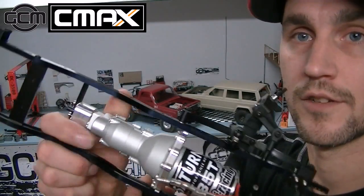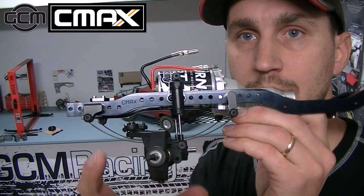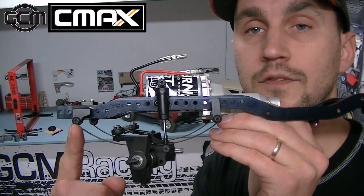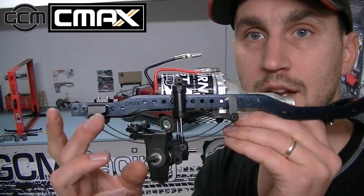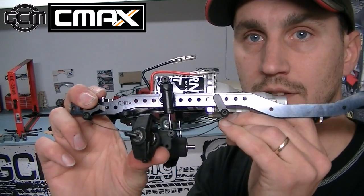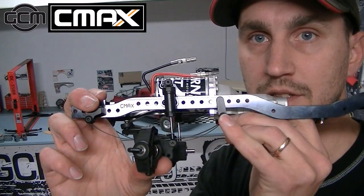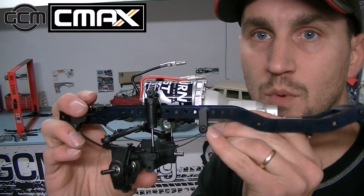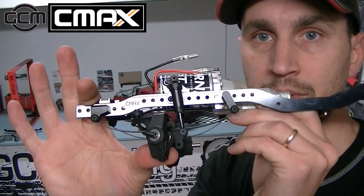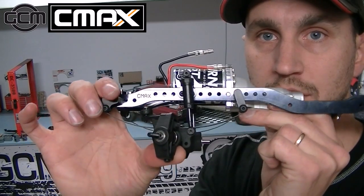The position of the rear swing hanger has to match your type of spring that you're using and the compression that you are using. So basically this eye in the front of the leaf will not move. Your wheelbase is set by this eye right here, and then as the leaf spring compresses, you can see the rear swing shackle actually has to move, because as the leaf gets flatter it also gets longer. And so this position here works pretty well, straight up and down when it's free, because usually when our trucks are loaded, they sit about there, and that gives you a little bit of an easy swing on the swing hanger for the rest of your suspension compression.